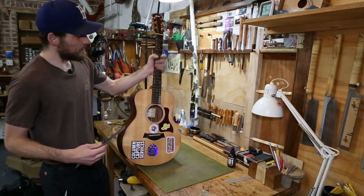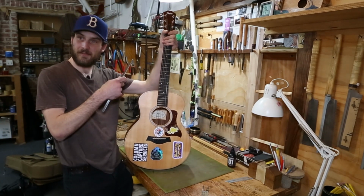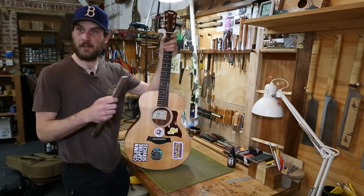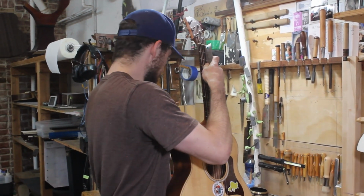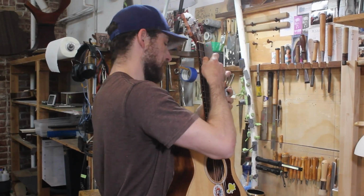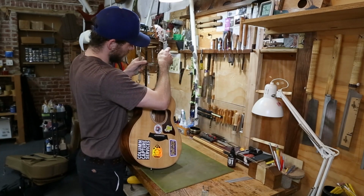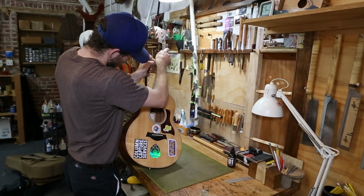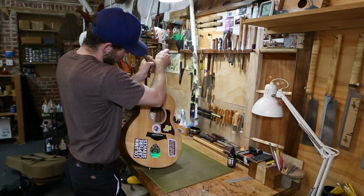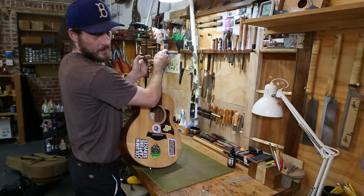So actually, when I'm doing this, I'm going to pick up the neck so it's not deflecting. Heavier guitars can deflect the neck a little bit and give me a measurement that I don't want. So I'll lay this on the center of the board, hold this up this way, and I'll come in from the treble side here. And so you're pushing down with the straight edge on the frets? Yep. The straight edge is going right on top, and I have just a little bit of friction right there. And so that's right at 6 thou.